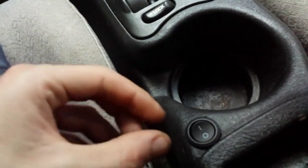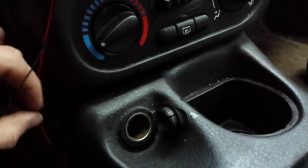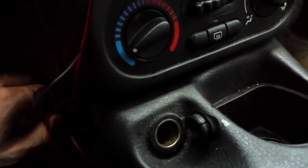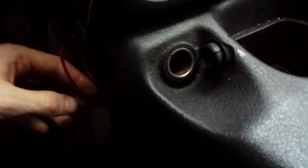I won't show you the switch detail — it's pretty simple, just two wires leading through and coming out the other side. But inside the dash, coming from the voltmeter, that's the ground wire. I spliced that in with a black wire I was sure was going to ground. The red wire goes to the switch, and then the other red wire coming out of the switch I spliced into a 12-volt wire I knew was always on. I soldered the connections and then insulated them. Simple as that.